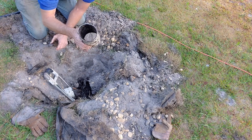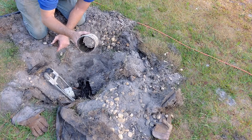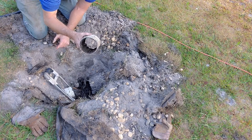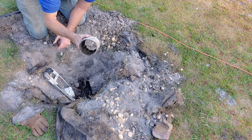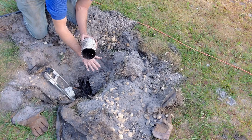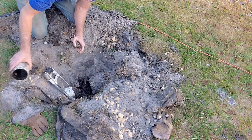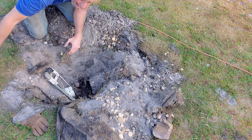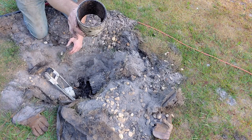That pipe's clean, buddy. What a myth about having to wrap your system. Somebody called it a burrito — eat the burrito, guys — but you don't need to wrap your system. I suggest you put fabric across the top because that helps keep the soil from dropping directly down into your stone. But you can see we've got real clean stone — we're in a sand base — and look how clean that pipe is. There's nothing in there. Nothing.